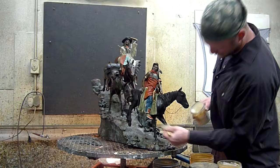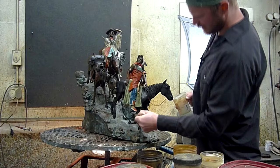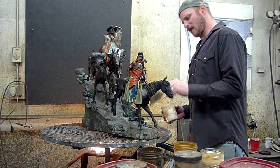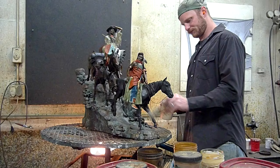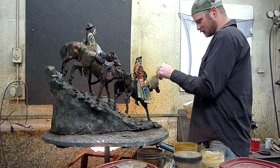What he's doing now is putting Johnson's Paste Wax — I think we use Staples? — it's a paste wax, and what it does is when it comes next to the heated metal, it literally melts and fills in every crevice. You have to do this to keep moisture out of the bronze so that it won't turn green.